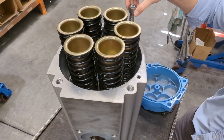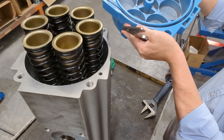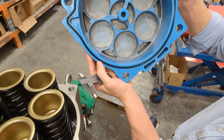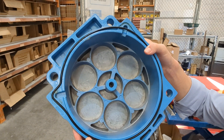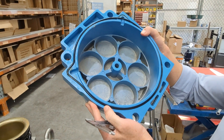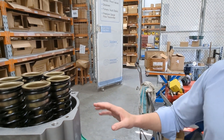You'll see these big hex head bolts on the end. This is a solid cast end cap with a dog ear gasket that goes over the top, and in the top of that is where the end of the springs sit. You can imagine if that was one big spring or a series of springs pushing against that when the bolts reach the end of their threads while you're taking this off — it can be under a lot of tension.